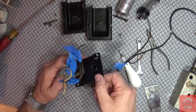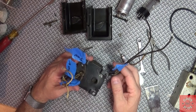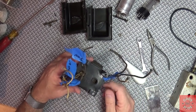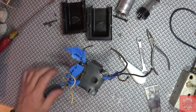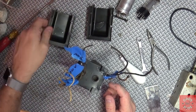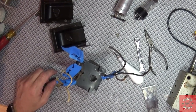Interestingly, the high voltage lines come out and run across the bottom of the transformer on a piece of cardboard, then come out the other hole. You'd think they'd have routed them out the same side, but the reason they didn't is probably to avoid noise — if they ran alongside the filament line it would likely create hum. Anyway, we'll take this all apart, clean it, paint it, make sure everything looks good, and then we'll be in business.